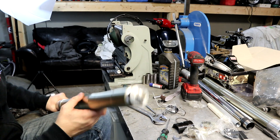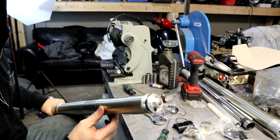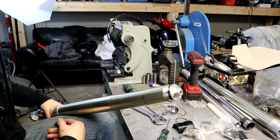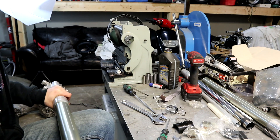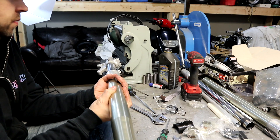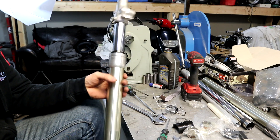I haven't put any oil in it yet. I'm probably going to have to play around with weights and volumes because we've changed the spring rate pretty drastically — we've chopped a bunch off. But that will get you close. From there you're going to have to play with everything else to see what's going to work well for you. But that is a significantly shortened YZ85 fork.